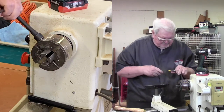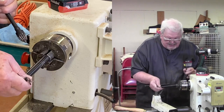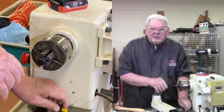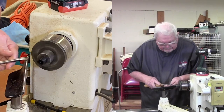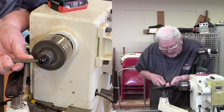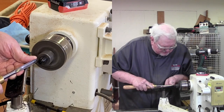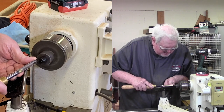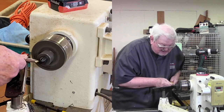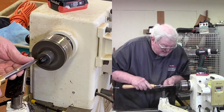Do another one just like it. I'll grab my piece of Delrin right here, take it in and put the bead on this one end. We're not going to take you through making all the handles because they're all going to be the same. But I am going to do one here, and I am going to do one in walnut for a different size wire — that way I'll be able to tell them apart. This really likes scraping — certainly don't get any catches that way. Using the side of the shallow fluted gouge.